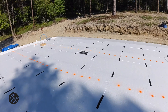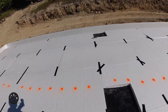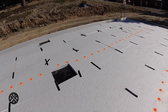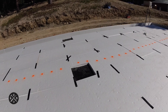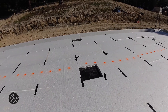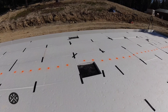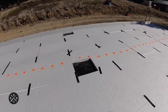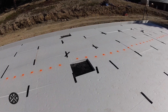I wanted to show you these holes here — I decided to prep for the future in case I ever want to put a car lift in, because I do work on cars quite a bit. My brother's mechanic has a couple lifts and told me what his spacing were. I went two foot by two foot. They say lifts are okay for a four-inch concrete slab, but I'm going to do 4,000 to 4,500 PSI with fiberglass mesh plus rebar, so it's going to be a really strong floor.